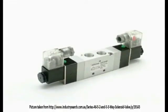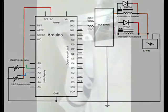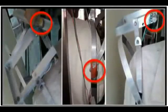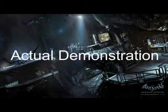Thus, the proponents can control the length of the extension and retraction of the piston rod of the double-acting cylinder. The proponents also designed a circuitry that can trigger the on-off switching of the solenoid valve. For the controller design, through their research about the position of joints of the human shoulder girdle, the position and placement of the potentiometer should be in parallel to the corresponding joint present.